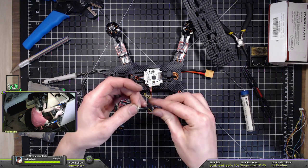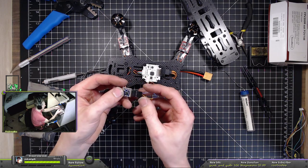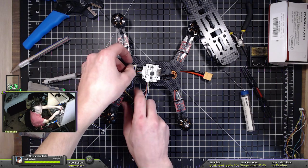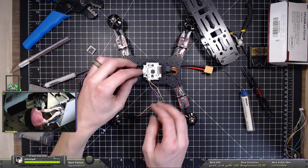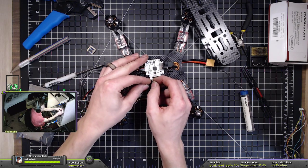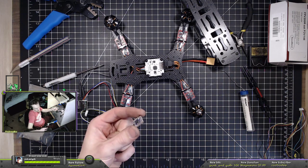Yeah. So those 4-pin headers will go into that, and that will get soldered into these holes over here. So we'll solder that together like that. That'll get mounted here, and we'll shorten these wires so that it's super clean like that. But basically, that will transmit flight controller data, such as throttle response, throttle level, altitude, pitch, yaw, roll, artificial horizon, battery voltage.